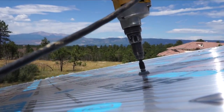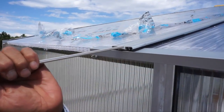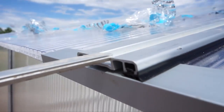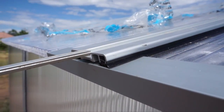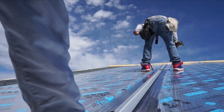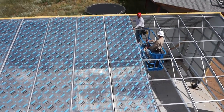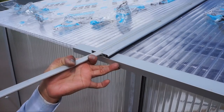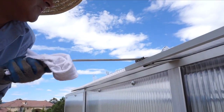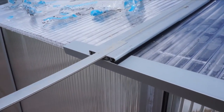Finally, there's a little, about an inch-wide clip that fits into the top of the top aluminum channel. It's designed to be able to click into place. When you get out into the field, there's a little bit of dust, maybe some metal shavings, and the aluminum tends to expand, so once you get that top channel screwed in on the roof and it sits there in the sun, it expands and makes it a little bit hard to click that top piece in. So what we do is take a rag, clean off all the dirt, and slide it all the way up to the north wall on the roof.